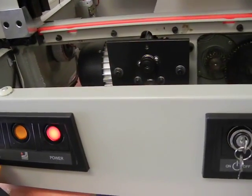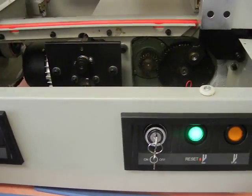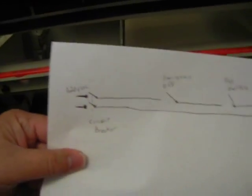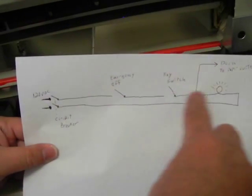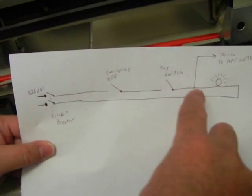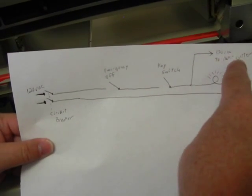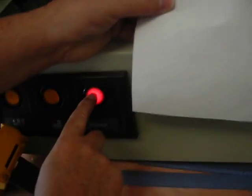There's only a small circuit that could be causing that on this machine, and I'm going to show that to you and how to do the test for it. This would essentially be the test for the circuit for the machine — basically it's just a loop here, and you need to have 120 volts after these switches are made going out to the machine.